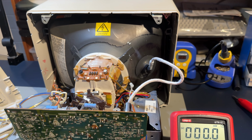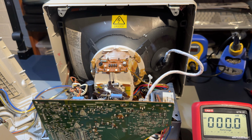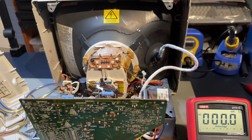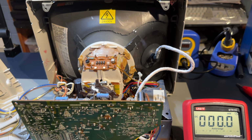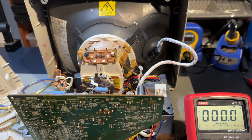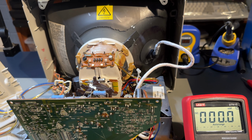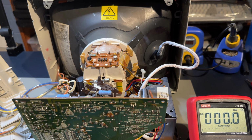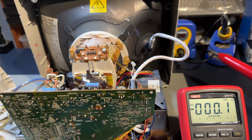This is my Apple IIGS RGB monitor that has developed an arcing sound. I've treated the high voltage line with Dow Corning 738, and that made a huge difference. But this is day 4 of this curing, and I've gone to turn it on, and it's actually amazing.